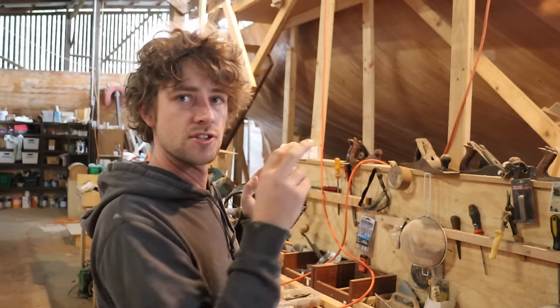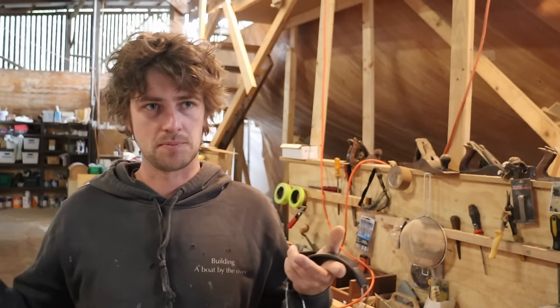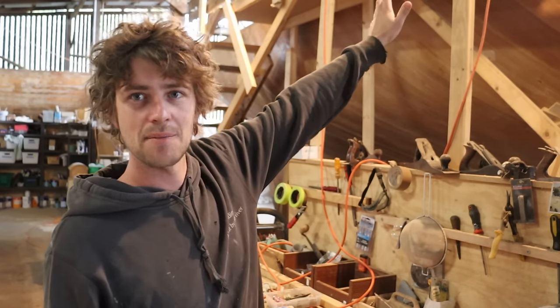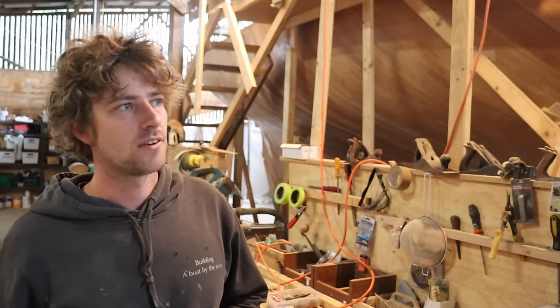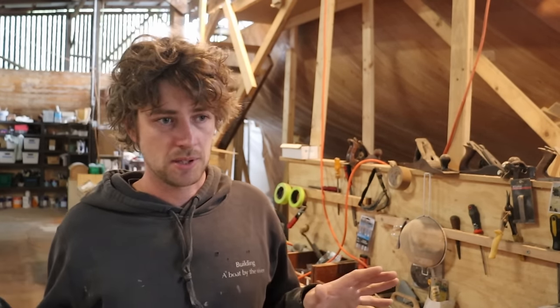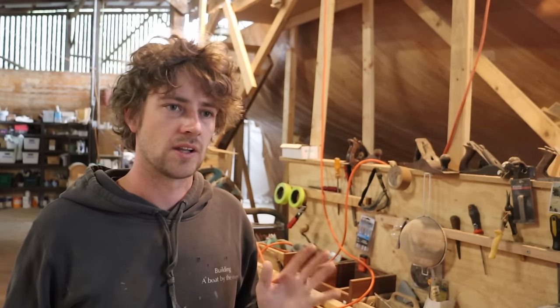But I think what we should do right now, before we think about laying a deck overlay on our cabin, is actually rip the timber up, so split it in half and rack it out to dry on top of the boat. It gets that moisture content in the sun instead of downstairs on the cold slab. And we'll probably leave it there for, it wouldn't take long, to be honest, to make it stabilize and get used to that temperature. Maybe a month or so, a few weeks. Really, the bit longer the better, probably. And then theoretically, it'll just dry out, it'll stabilize, and then we can lay it, oil it, and it's done.